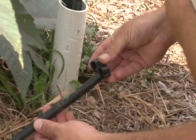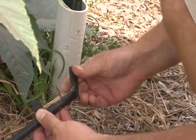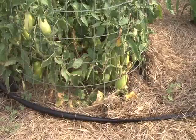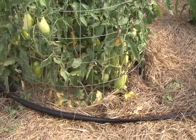To terminate the header pipe, you can do a couple of different things as well. You can buy pre-manufactured end caps that attach with a reverse threaded coupler, or you can very simply just crimp the end of it and use a small coupler connector to hold that crimp together — even bailing wire can work just to keep that water from going anywhere.